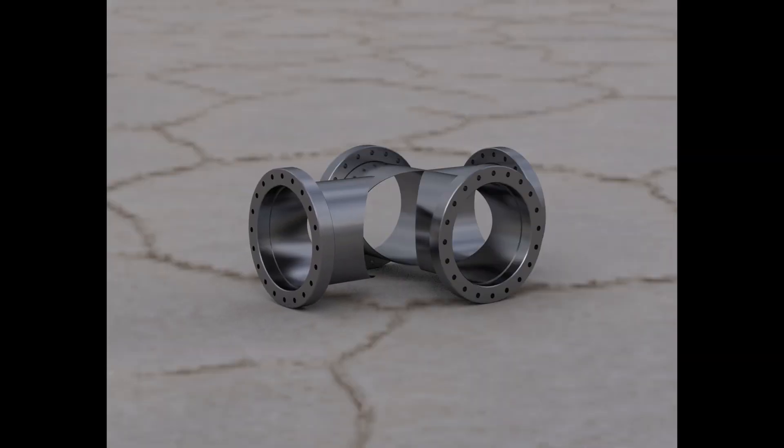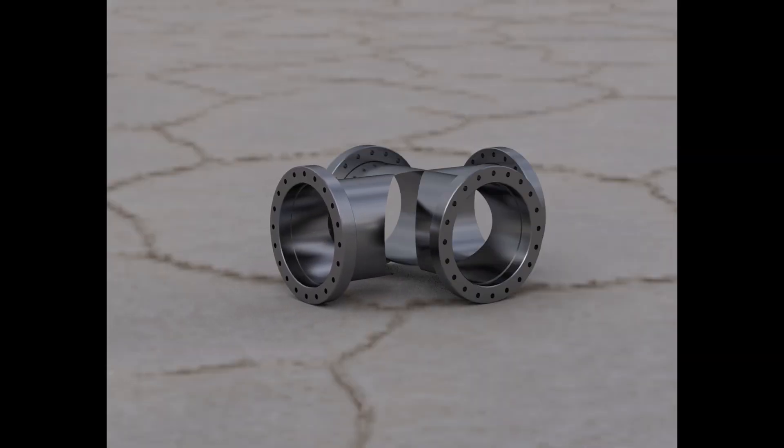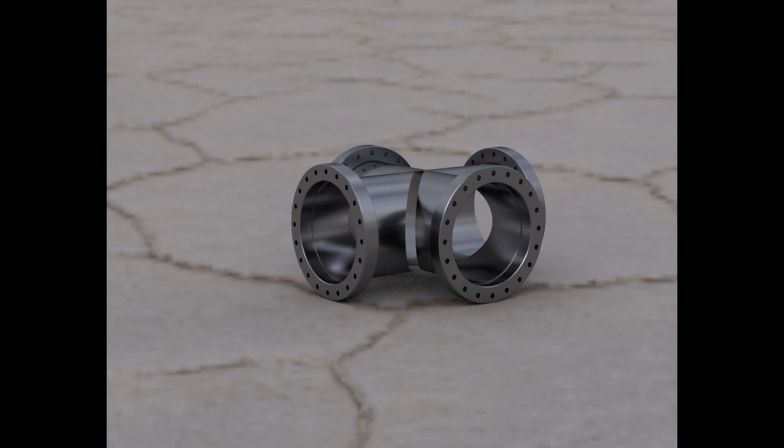This animation shows the bevels in the tubes and how they fit together when fabricating a vacuum chamber. The welds on the vacuum chambers are tiny — they're vacuum welds and don't need to be larger structural welds since the vacuum force is pulling everything together. The vacuum welds simply have to be airtight, they can't leak, and they have to handle only one atmospheric pressure. One atmospheric pressure is about 15 psi — that's not much.